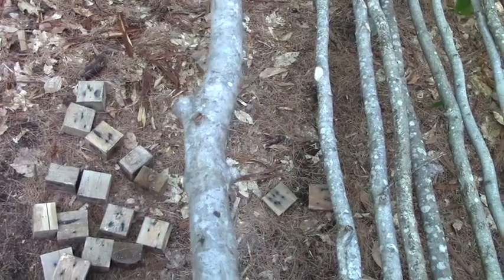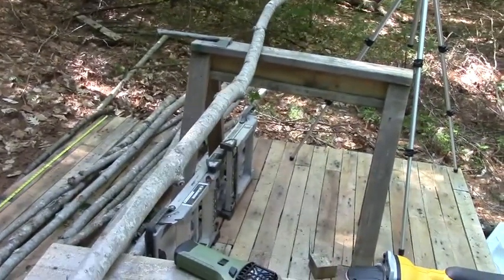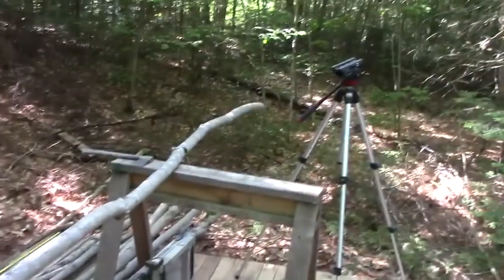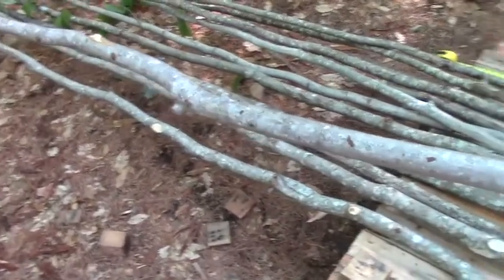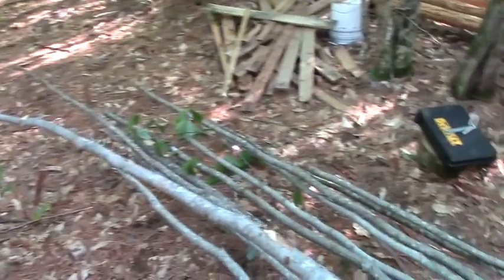Here's another thing I'm trying to eliminate. Any of these spots like this, I'm gonna cut this right here, because not only do we have this knot, but this starts, and let me back up. You can see it just kind of cuts off that way. Now, it's not the only spot in this where that happens. There's another one further back right there. But if I can take this here and cut this off, it's a pretty good diameter right there. And then measure my 14 and a half feet from that. I think we're gonna get a pretty good piece, and that's gonna give us a decent thickness. We're not gonna be so thick that it's too heavy, and yet we're not gonna be so thin like we would be out on the end. That's really not going to support that heavy tarp. All right.